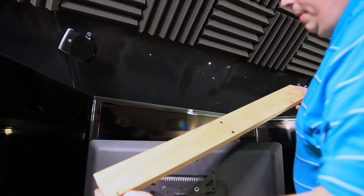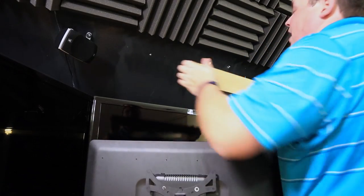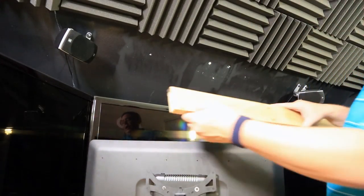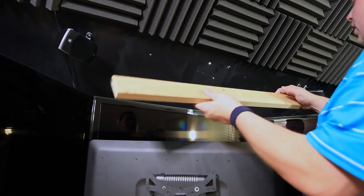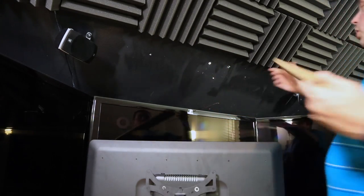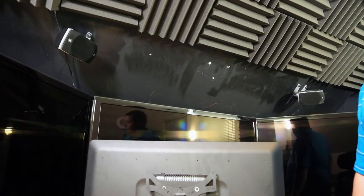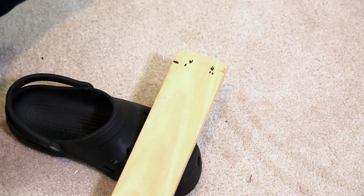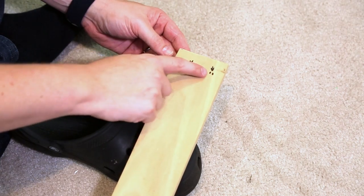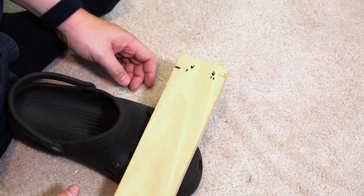Remember, I made it a little bit long so that I could center it up on the monitor — that way I have equal length coming out of both sides. So the next step is I'm going to measure and drill two pilot holes on both sides so I can run the lag bolts into the wall, and I'm going to remove these because I don't need those anymore. I went ahead and measured out the 24 inches between the two points for the joists and made several marks — the inside ones — for the screws that I'm going to run into the wall to hold this to the wall.